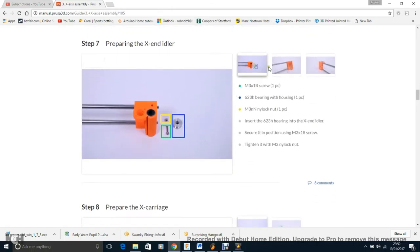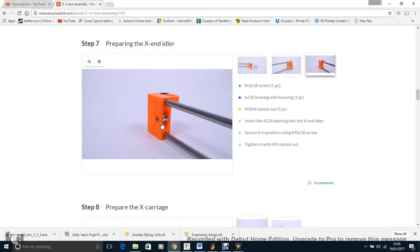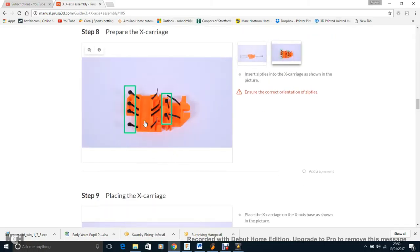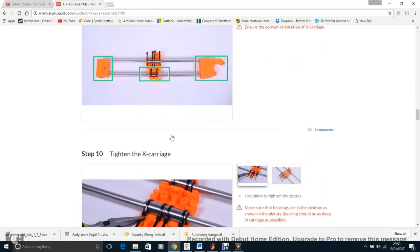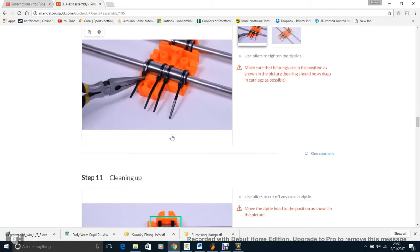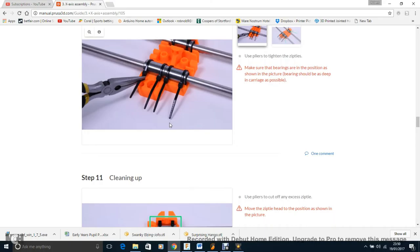Step seven: add the idler with the little pulley. Once it's in, you don't need to tighten it too much — it just needs to spin freely. For the zip ties, it's important they go the right way around — the flat side here with the little tab sticking out. Do them up as tight as possible around the bearings and cut them, because you don't want any looseness or vibration. Excess vibration builds up at speed and can cause the carriage to stiffen and skip steps.